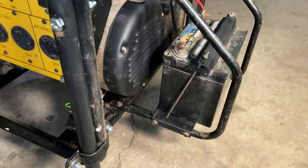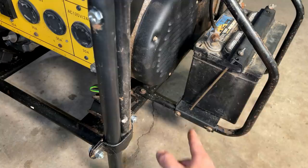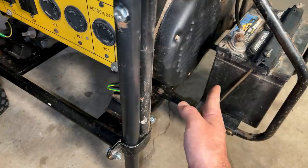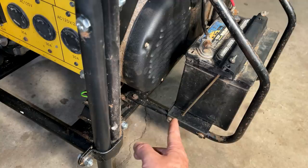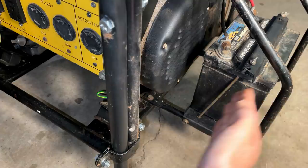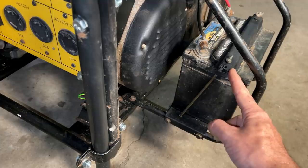This might be a little bit sketchy, I'm not sure, but this tray has a lip right here, which keeps the battery from sliding any further that way. And originally, this tray was the other way around, so the lip was here, and was actually pushing the battery right against the stator. And this is the air intake for the stator. You don't want to block that. So I assume that it should be like this. It kind of makes sense because this battery tie should be pulling the battery toward that lip, and when it was the other way, it wasn't really doing that. So I think I'm going to work at this a bit more. I really want to get that where it belongs and leave that tray in this orientation to provide enough cooling.